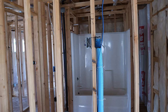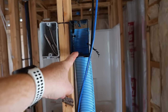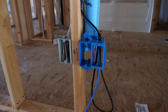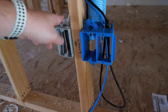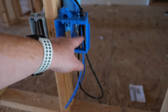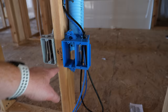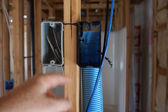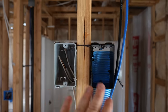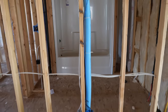Over here, I plan to have a TV for the kids. They would run an outlet to where the TV would be mounted, and then they have a Smurf tube here that goes down so that you can easily route your HDMIs and everything from your entertainment center with your Nintendo Switch or Xbox all the way up to behind the TV. They also put an outlet here with a cover that has Ethernet as well as a coaxial cable for TV. If you just put a hole in a wall and feed an extension cable or power cable through it, that is actually not allowed — you need to make sure you have an outlet up here next to the box that is up to code.